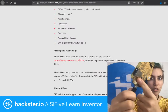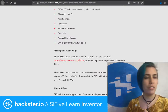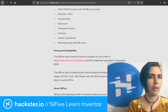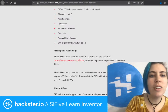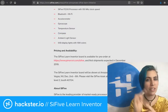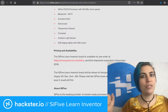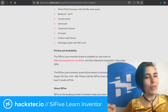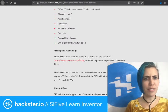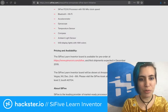It has an accelerometer and gyroscope in one chip. It got me a little confused at first, but it actually has a gyroscope and magnetometer, so you've got nine axes of inertial measurement — accelerometer, gyro, and magnetometer. It also has a temperature sensor and an ambient light sensor.